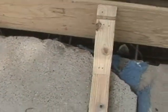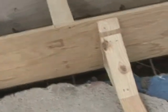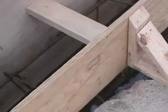We've screwed our forms on the outside - you can see where my foot is, screwed that in. We made sure the outside edge is perfectly square. These inside blocks, once we start pouring, will come off - that just kept our distance the same all the way down so we wouldn't have a ripple look in our concrete.